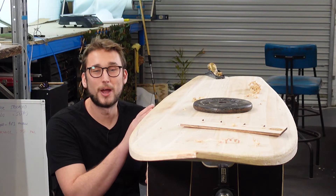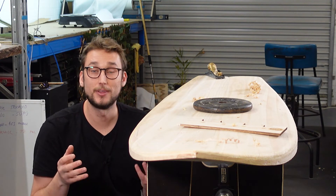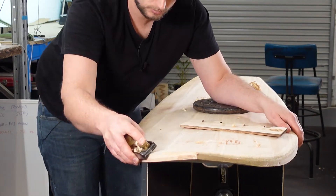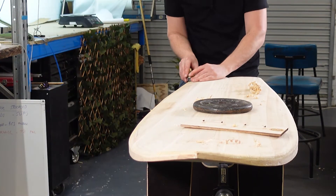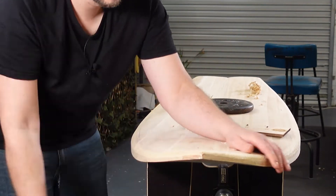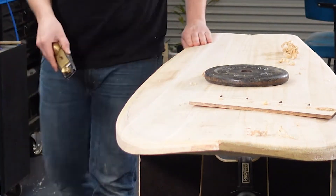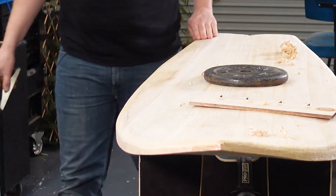Now that we have our rail close in every section we have to refine it to make a nice consistent edge, and that is where those long continuous strokes come in with our block plane. Up until this stage I was working with the plane set fairly aggressive for stock removal; now I'm going to wind it back so only a very small amount of the blade is protruding and we're taking very thin, whispery cuts. This means that instead of creating big flat spots we're only removing very small sections. As you do this you're also going to be rolling the block plane slightly further up as you progress to create a consistent curve.